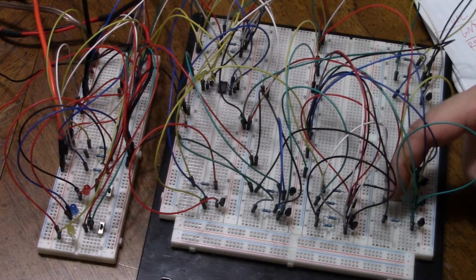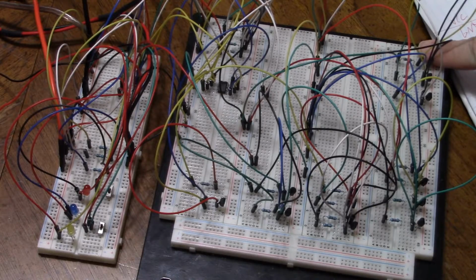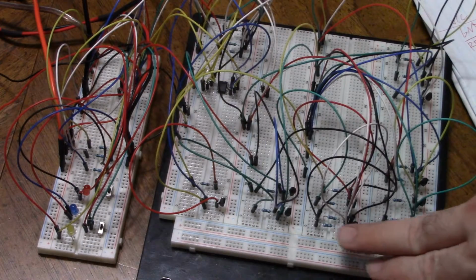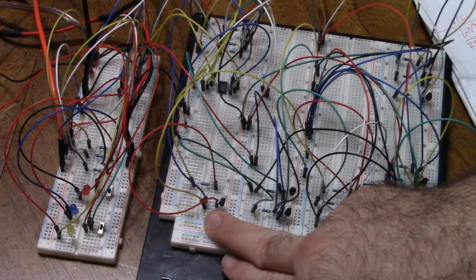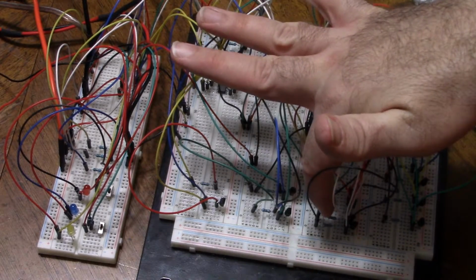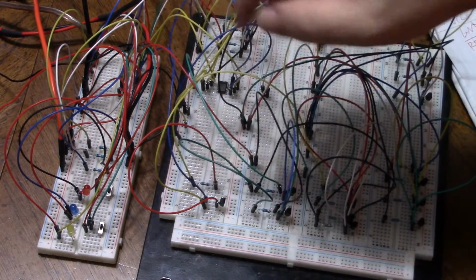The reset signal comes in here, which is bridged over from the board. And the Q feedback comes in here. So this puts out Q, and this puts out Q0, which I have brought over here. So here's Q and Q0 that are connected back over here with feedback. Then I take the Q0 signal over here to the discharge open collector. So that goes out to discharge. Then I have the double inversion right here. So 1 inverter, 2 inverter, make a buffer. And then that is finally brought over here to the PNP and the NPN push-pull, which is connected to output.